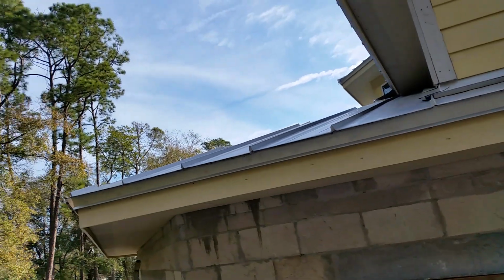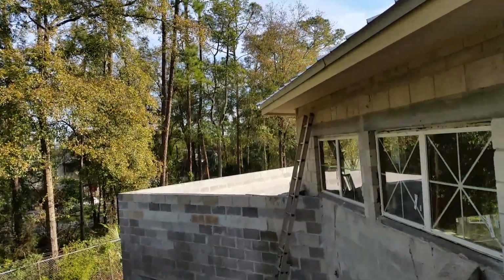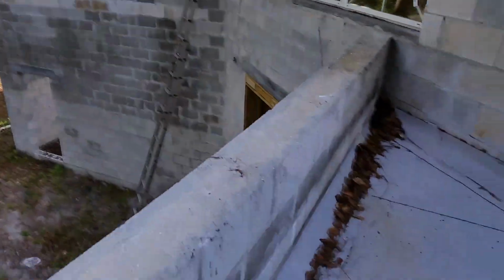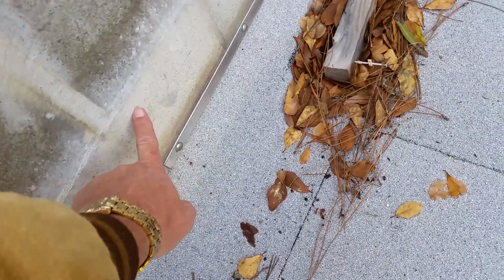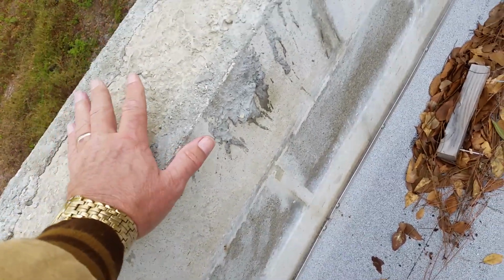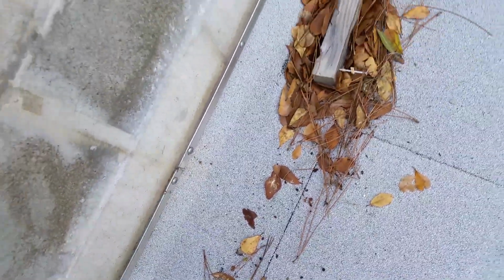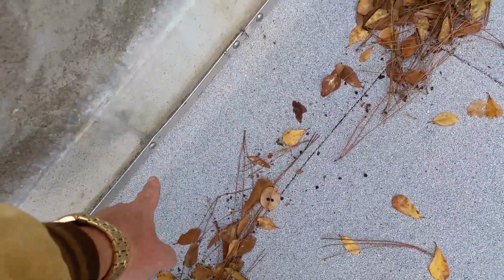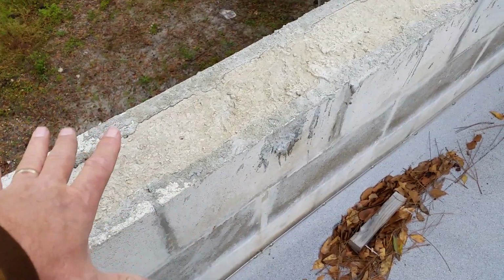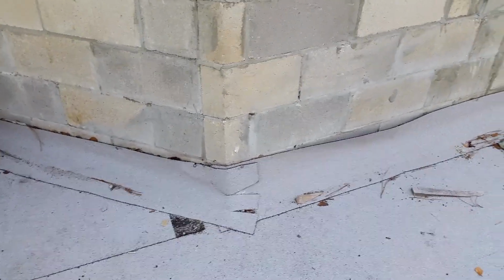rake. Obviously this thing's been sitting here for a while because the membrane is actually ate up. That section over there, I don't even know. I'll have to look at the print and see what they're doing over there. But like these walls here, the flashing should have come up here, stopped there, and then another piece after your plate was on, and your membrane comes down and on top of that. To seal that off, you can bring it up here and put a termination flashing, but it can't be at the top of the cant strip. Then you put your coping cap on or drip edge detail, whatever you're going to put there. On this back wall, you could come up 18 inches and put a stucco stop, but not just a term bar.